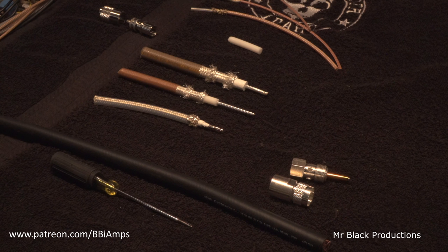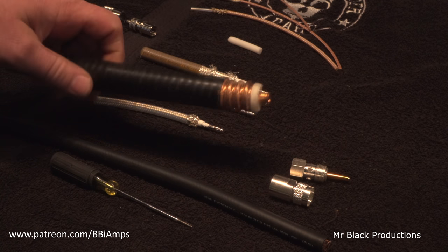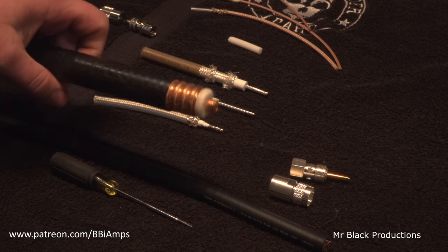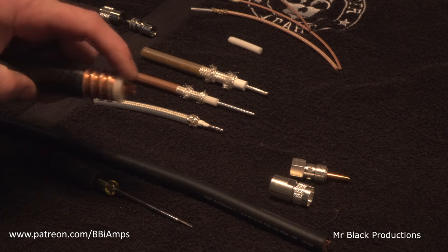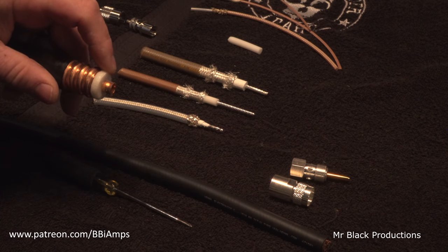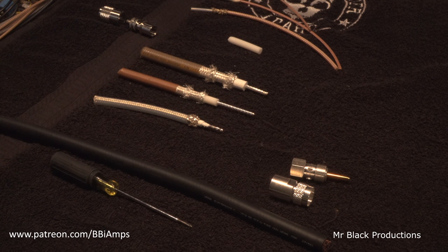Just saying — if you don't know, no matter who you are in this hobby, don't be afraid to say you don't know. If somebody out there that goes to sleep fondling coax at night knows of a 7/8 equivalent made of stranded center conductor, Teflon dielectric, and a braided shield, I would love to talk to you. Not 218, but the equivalent to 218 would be awesome, by the way. We don't care what the cost is — we're just looking for it.